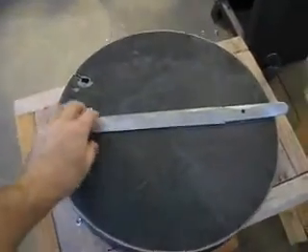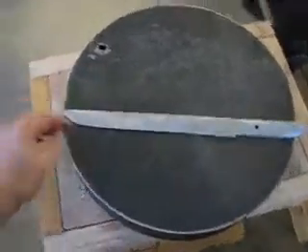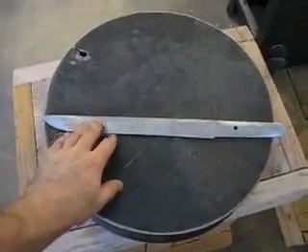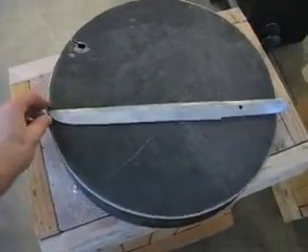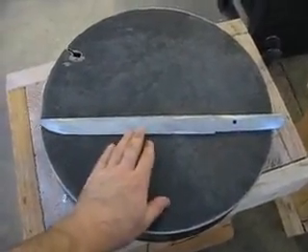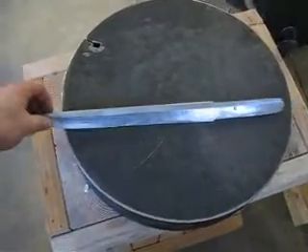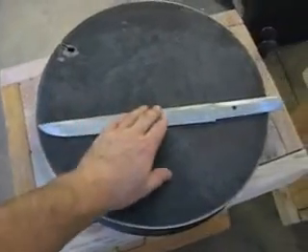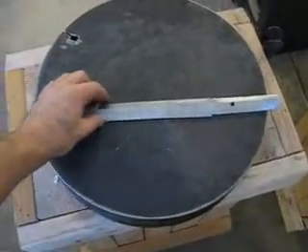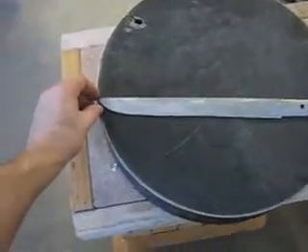Another episode of Forged Diaries. This is my most recent practice piece that I'm working on. I'm working on developing Shinogi Zukuri geometry. I know that Tantos or Daggers of this length are typically Hira Zukuri and not Shinogi Zukuri, but I'm just trying to learn the geometry of this type of blade so that I can move up and make longer ones — make Wakizashis and Katanas.